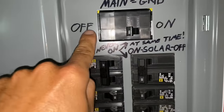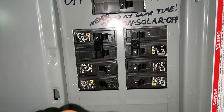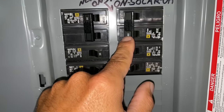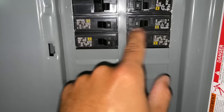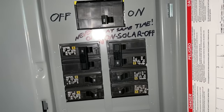Right now the shop is off because that's the mains coming from the pole. You never want to double up your electricity because fire and explosions happen. So this is our 60-amp breaker coming into this panel from our power inverter — it feeds all the shop circuits. When we shut off the pole out there, we can click this one on and it's going to back-feed out that way.